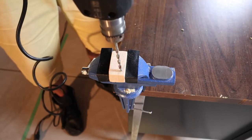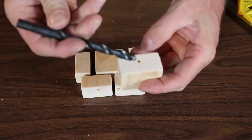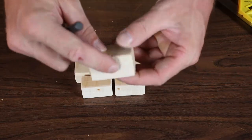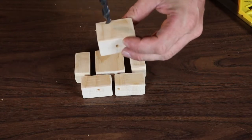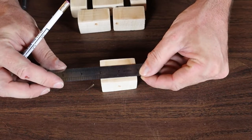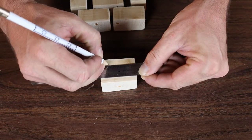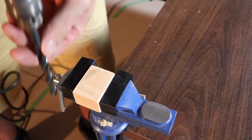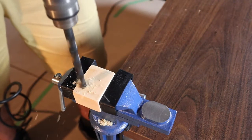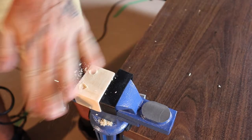All the instructions and dimensions are in the description below if you're having any trouble. What I meant by countersinking: I'm going to take a bigger drill bit and drill into the top of the head, the sides of the arms, and the bottoms of the feet, so when the rope or twine comes through, it sits recessed in. I'm going to use this same size drill bit for the eyes. For the eyes, I'll measure so they're nice and centered — the head is one and seven-eighths wide, so I'll notch back a sixteenth and mark three-quarters in from each side, then drill a shallow countersink hole — just enough to make them pop.